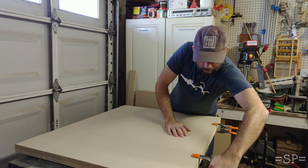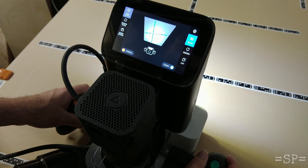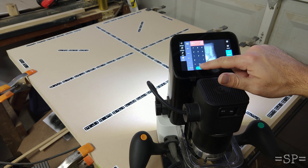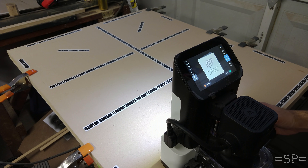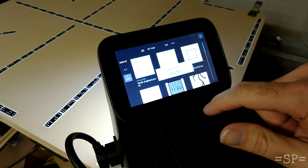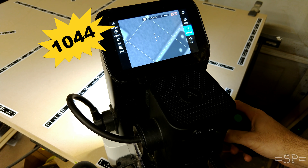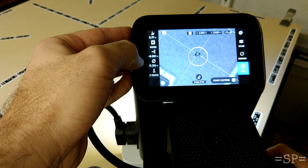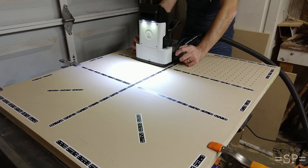We're starting with two pieces of 3/4 inch MDF. We put down the Shaper tape and scan in the work surface. The different pictures of the dominoes allow the router to track where it is on the work surface while you're cutting. The next thing we do is align the X and Y axis so that our piece is square within the scan in the Origin. I went into Inkscape and created a file that has hundreds of holes that are going to be where the vacuum goes down through the top of the table. We import that in, then set up how deep the holes are and what bit size I have, and then it's just a matter of grinding through the holes.